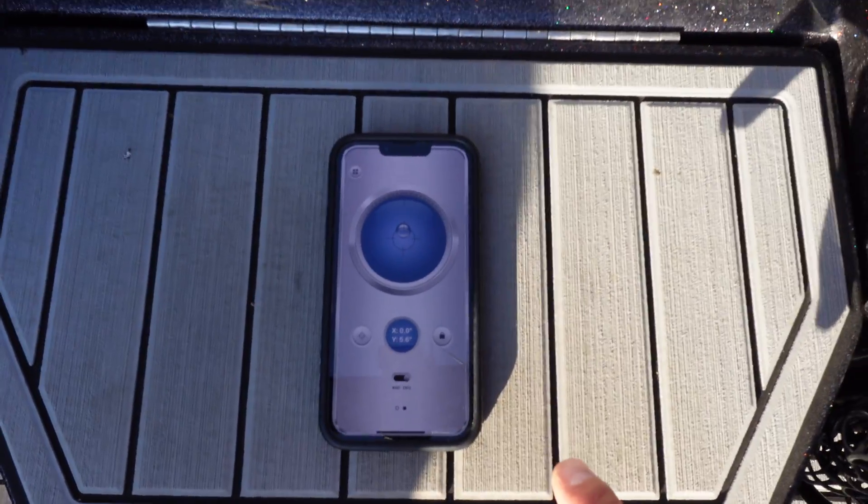To establish a baseline, you're going to go in and reset the auto pitch and the auto roll function. You can do it in two seconds. The way I found my happy spot on the boat is — if you didn't have the ZipWakes installed, you could just take a bubble level like this, go out on the water, get your boat running at a comfortable speed where your trim level is right, at the clip and posture you'd want under normal cruising conditions with a normal amount of chop. Once you find that sweet spot, just put the level on the deck and take note of where it's at.